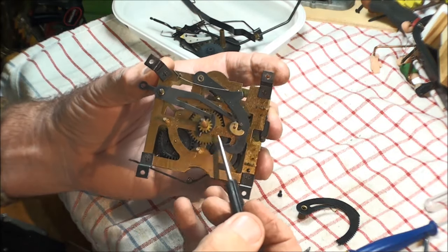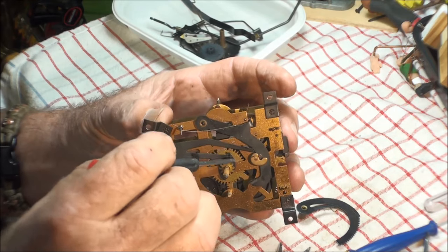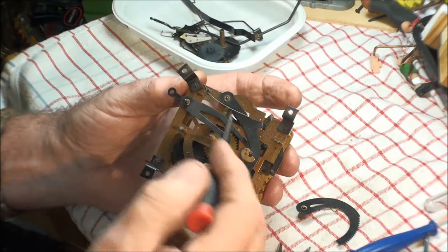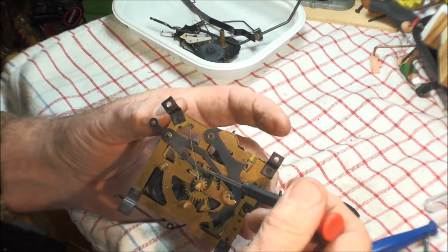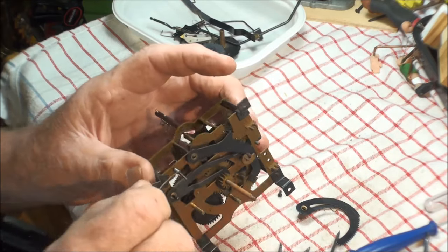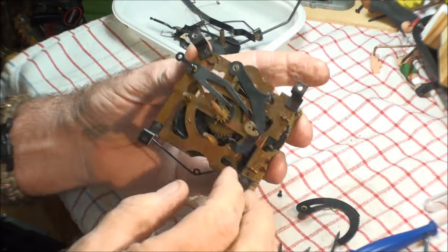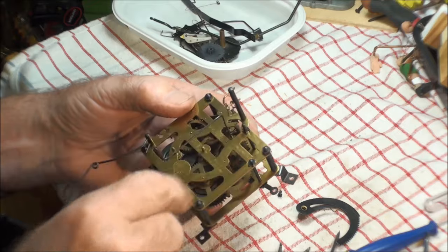Of course, you got your little 2-point star wheel here, and when this lever drops down off the top, that tip of the star wheel, that's when the clock knows now it's time to start cuckooing. But to get this wire off here, you're just going to lift it up and bring it around all this stuff here. Comes unhooked from the frame right here. Then you get that off. So that's about it that we can take off here. Now we need to take off these clips over here.